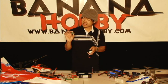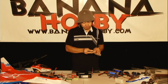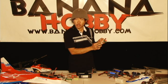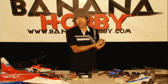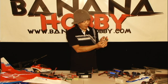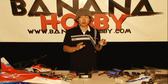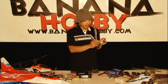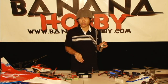We carry these little cell voltage display units — you plug it into your battery's balance port and it tells you the individual cell voltage of each individual LiPo cell. You want to keep it at an optimum level. I never drain them past 3.5 volts per cell. On an 11.1 volt pack, each individual cell will have a max voltage of 4.2 volts per cell. You do not want to drain them past 3.5. I don't like draining them past 50% of the battery capacity. I know people that don't want to drop it past 3.0 volts per cell — that's fine too — but just keep in mind, if you drop it past 3.0 volts per cell, you're basically killing your battery.